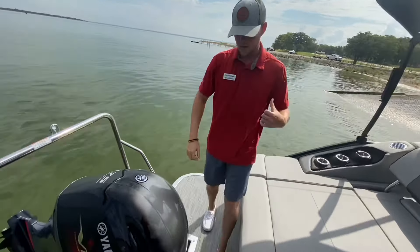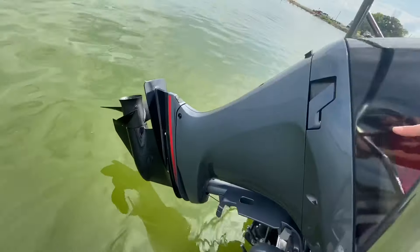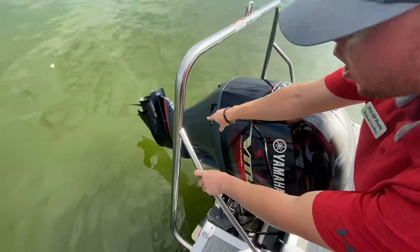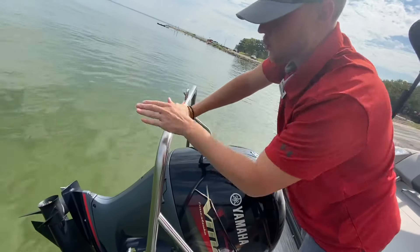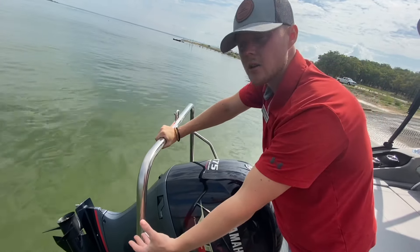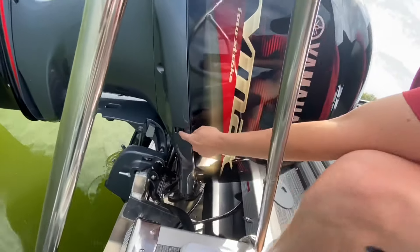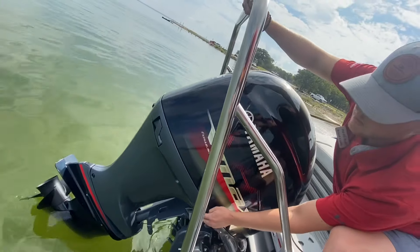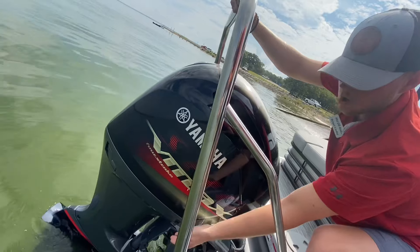Now that the battery switch is on, I have power to the boat. Right in front of the propeller you can see that little black slit — that's your water intake. On an outboard motor, you are never going to start it unless those intakes are in the water. The flat piece above the propeller is called your cavitation plate. I get the motor deep enough so that cavitation plate is right at the surface. I don't want to lower the trim all the way down at the boat ramp since it's shallow and I don't want to hit the skeg or damage the propeller. I'll use the trim switch on the side of the outboard to lower it down. The cavitation plate is right on the surface and the intakes are in the water — we are good to go.